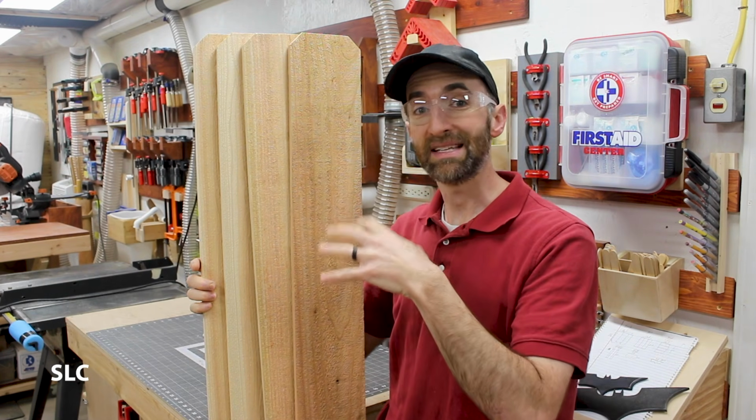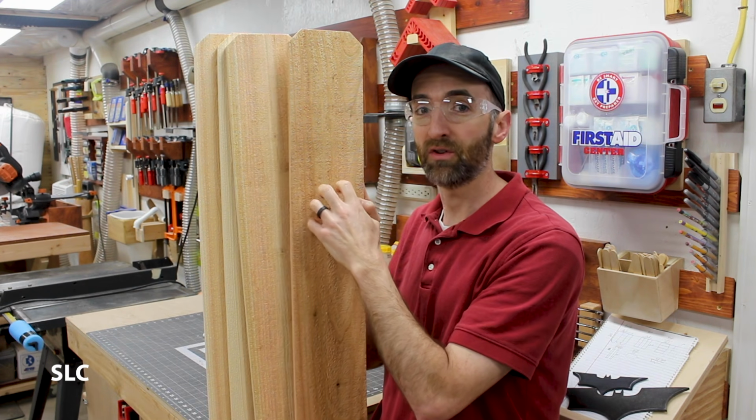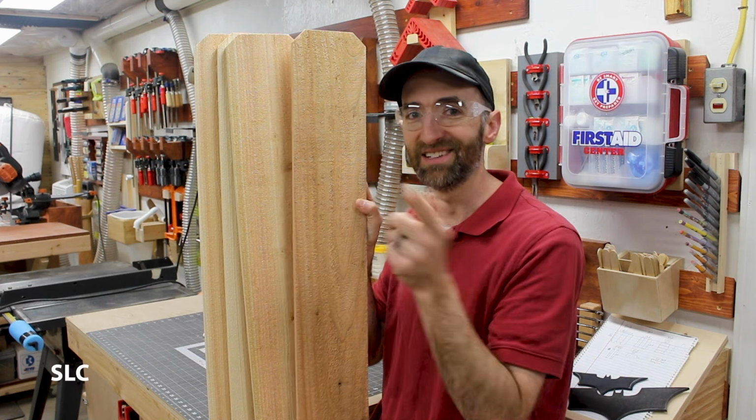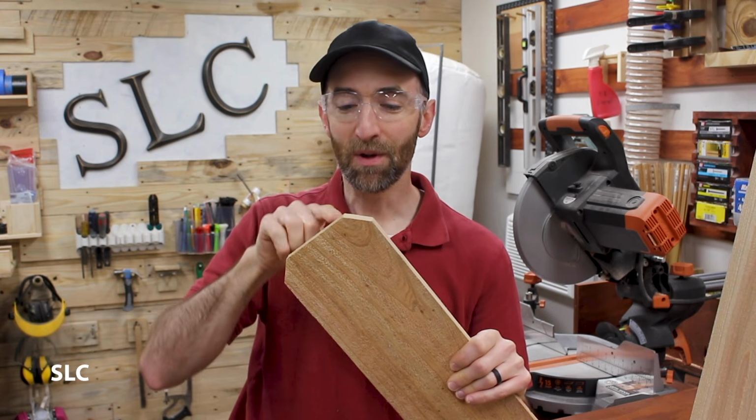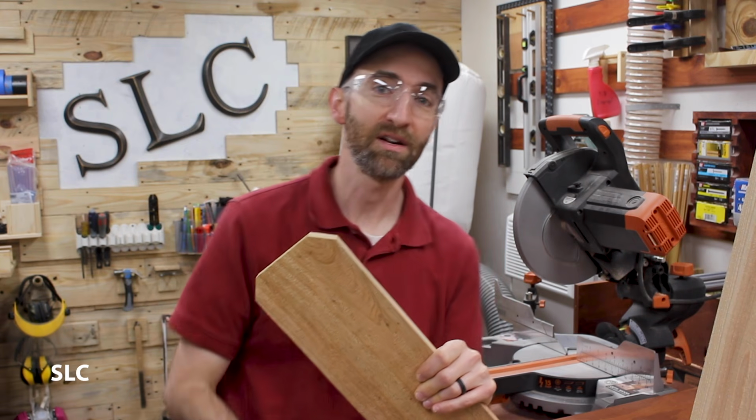These come in a 1x6x6 format, and also it's nice and rough just from the factory, which would be a good starting point for this bathouse. Let's do this. Now the top of the cedar fence post already has a corner cut off. I'm actually going to incorporate this in the design, so we're going to cut these down on a miter saw.